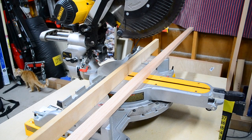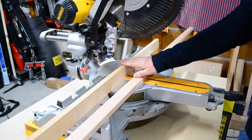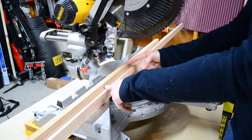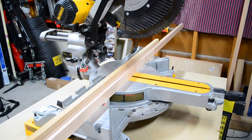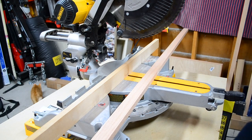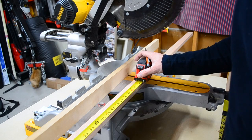One thing I found very beneficial when making the legs and cutting solid wood where both sides need to be perfectly finished: if you're not using a table saw, it's best to make a zero clearance fence. This one's not perfect but it works amazingly. That way I cut all my pieces vertically and don't get blowout on the back — which is only about a half inch to three-eighths of an inch. It's a waste of money not to make one. Most likely you have some MDF lying around, or you can get a piece for typically around five dollars from Home Depot.